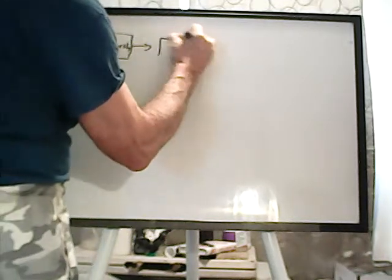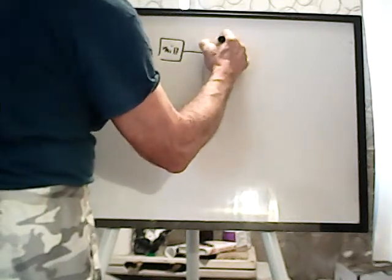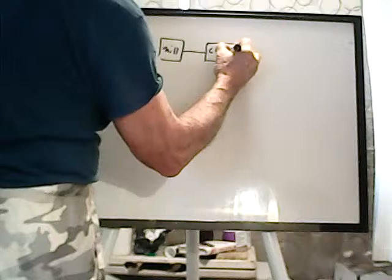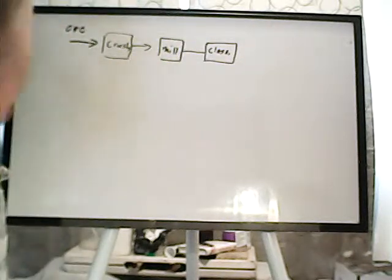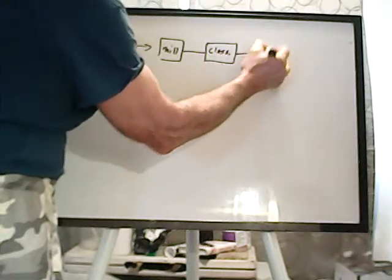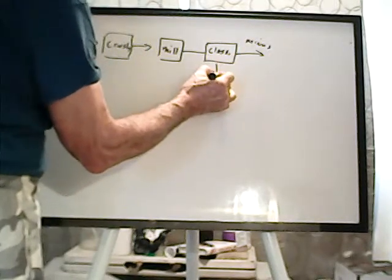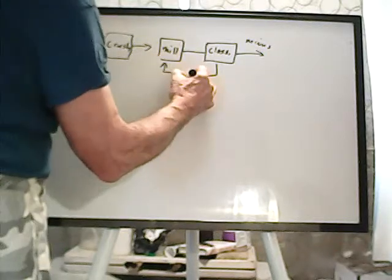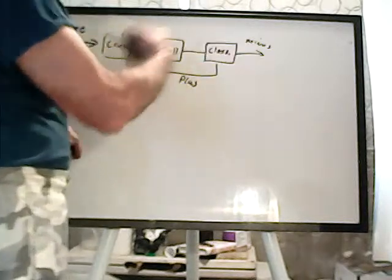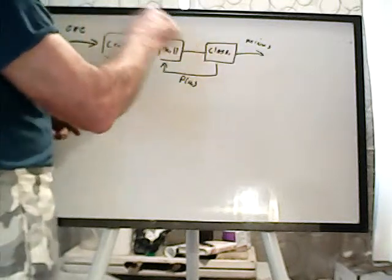Then you have your mill. And then it goes to classification. Basically, there's various ways of doing it. Screens are one of the more common ones. And then the undersize, the minus goes here, and the plus goes back here. By doing this, you can give it a fairly light grind, scalp out this finer stuff as quickly as possible, send it back for regrind.